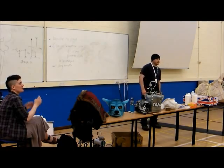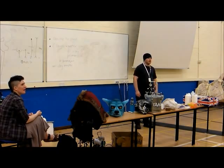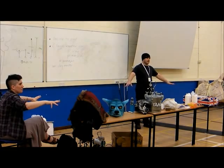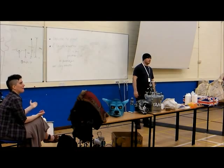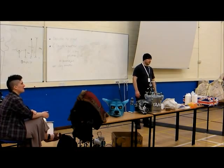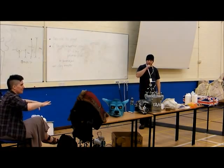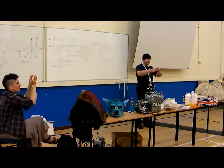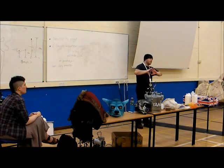Pepper, you know they have 3D models in games made of little triangles called polygons? There is a program that will collapse those into a flat thing that you can then build. When they're making paper craft, that's what pepakura is. Pepakura. It's a Japanese thing, but they use it for making paper craft. You collapse the model flat, print it out on your printer onto cardboard, cut it out, build it up again, put it back together 3D again. You've got a 3D model which you can then fiberglass, fill the surface to make it all nice and smooth.